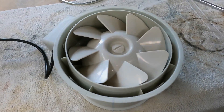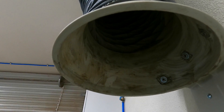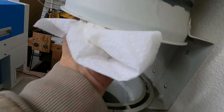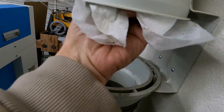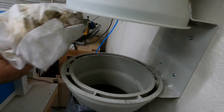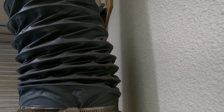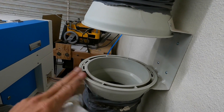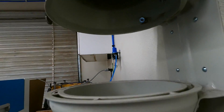You can see that the housing is pretty dirty — I've wiped it out once already. You just want to make sure you get the housing nice and clean. I use paper towels soaked down with LA Awesome, because this side — the exit of this fan — really gets pretty nasty. The other thing you're going to want to do is be careful when you're running your hands around here. These edges can be sharp, so just be careful and don't cut yourself. I think we've got it clean, so we'll go ahead and install the motor back in now.